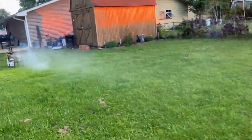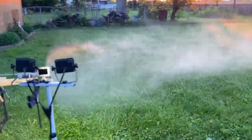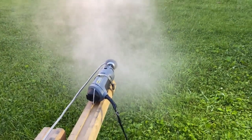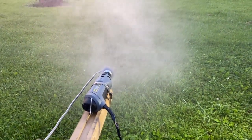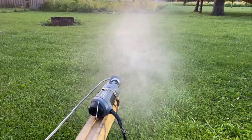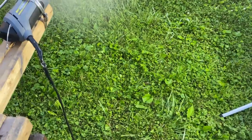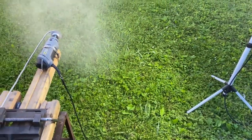I need to get some profile video of this vapor cloud to see what type of control air I'm going to use to tighten up the cone, and also how big the combustion chamber is going to be. One problem with an atomizer nozzle run by a high pressure oil pump is that they don't like to be turned up or down much — if you turn it down too low to throttle the engine, it no longer atomizes the fuel. If you turn it up too high, they can't really accept much more fluid.